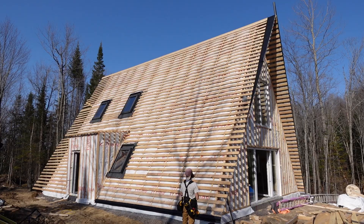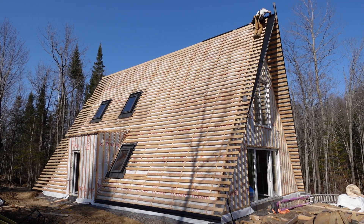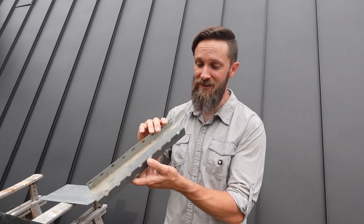After I finished one side of the roof and installed all the connecting pieces along that side, when I started the second side I installed these pieces as I got to the top of each row, and simultaneously started installing the ridge cap working from one end of the house all the way to the other. I chose to do it that way because my ladder would have scratched the roof, and I didn't want to sit on the ridge cap of this really tall house and work my way backwards installing it after all the roofing was done. Slowly but surely you work your way along screwing the ridge cap down to the connection pieces between each rib.